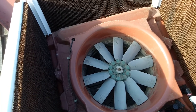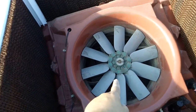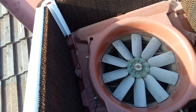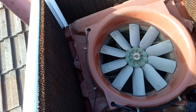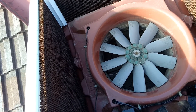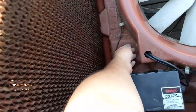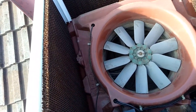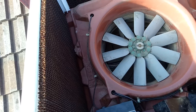I only had this running for two minutes and it got so hot I couldn't put my finger on the end of the shaft. It has cooled down now, but that would have been because it was arcing out and potentially not even connecting properly. I hope I haven't damaged the motor — it's been a couple of days playing up, and I was trying to fault-find whether it was a pump or motor problem. The plug sits in behind this section so you can't see it — you don't know it's arcing there and not in the motor. And when you're up here with the wind, you can't smell where the burning's coming from without physically pulling everything off and having a good sniff.